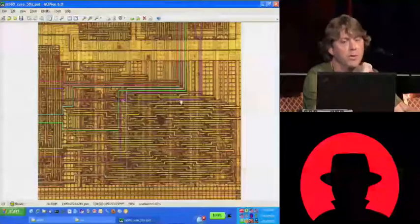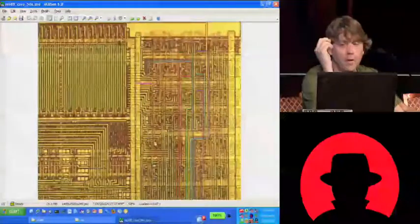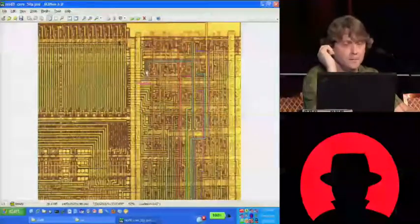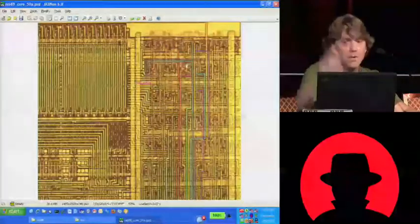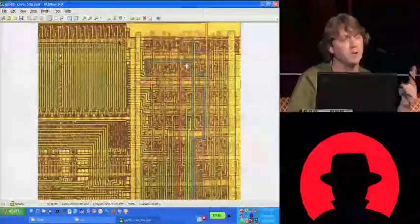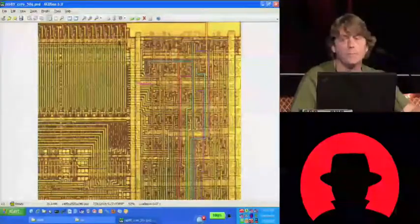But the most important thing of the chip that makes this thing tick is they come up here, they trickle through, and then they plugged into 8 flip-flops up here. And then they had a nice line here that followed through the inverter that basically was always driven low. So hold it low, set on the bus, eavesdrop the bus, and you walk the bus with 1 needle. So with 2 needles, you dump this chip, and you've dumped every other chip that I've spoke about so far today.